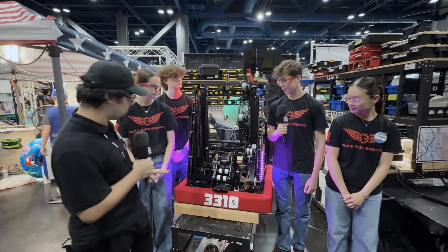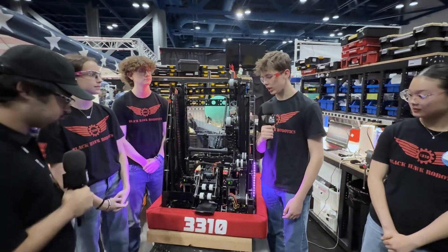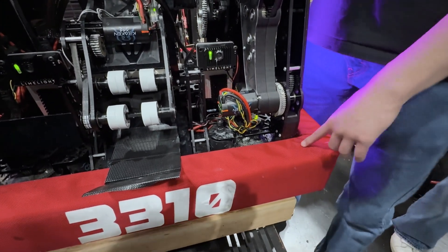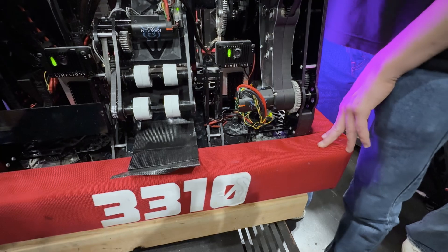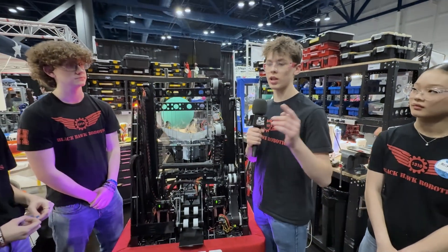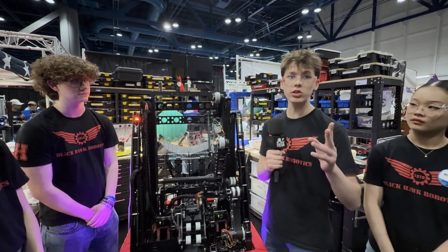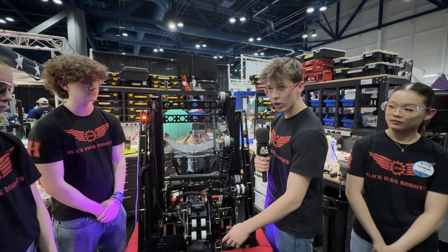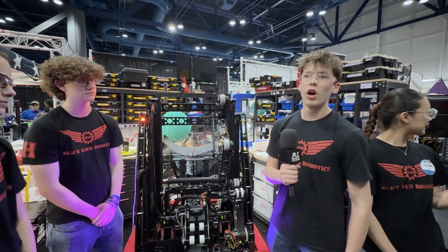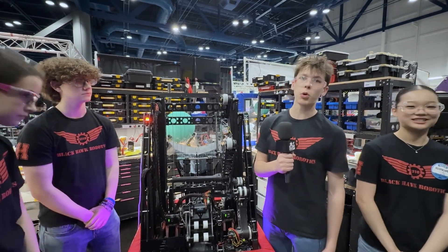Colin, talk to me about the drive base. So the drive base we use is a West Coast Products X2i — the gears are inversed. The whole robot uses Kraken X44 motors except for the drive base, which uses one X44 and one X60 Kraken for each module. The X60 is the drive motor and the X44 is the steer. We also use an L1 gear ratio because while it is slower, it is more precise.